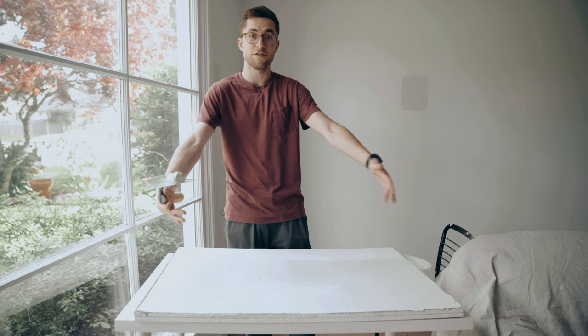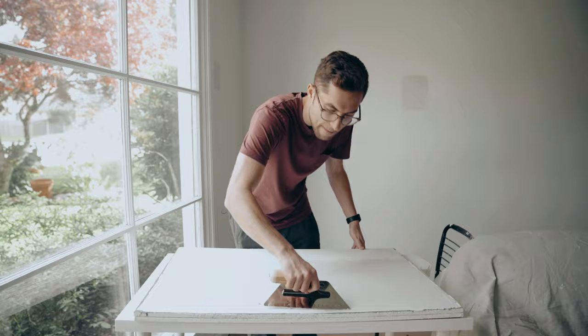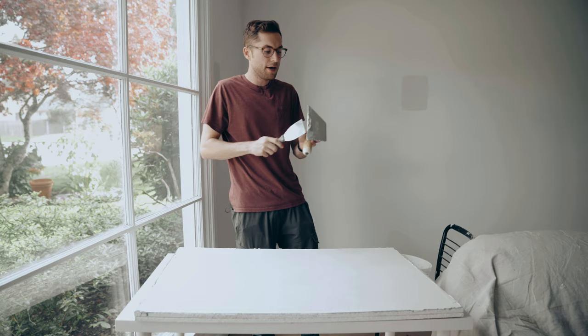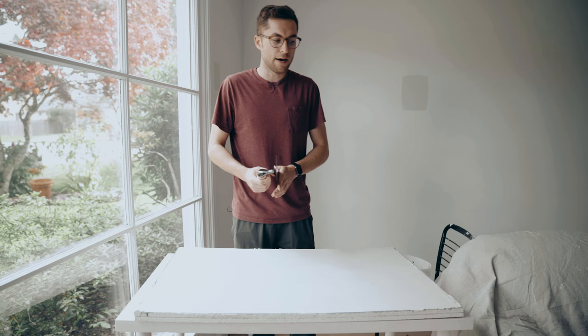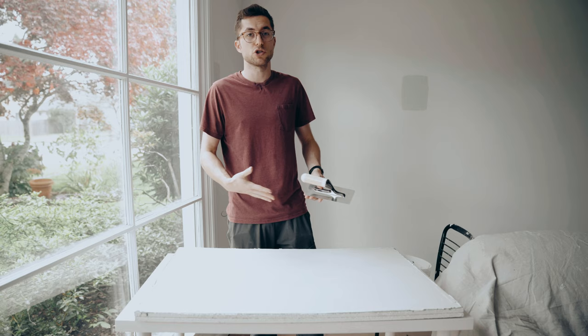On the second coat, if you're on a wall, you want to work probably about a three-foot distance and then go back and burnish. Since you've already applied that second coat in a compressive way, burnishing is really about applying more pressure and adding friction to the plaster itself — that'll bring out those shiny spots. In this case it doesn't get that shiny because this is more of a matte look, but in other cases it'll get really shiny. I have a specific burnishing trowel which is a little smaller and more square — that allows you to apply even pressure — but you can use your normal trowel as well.